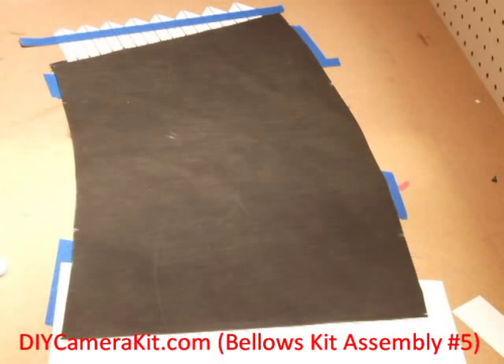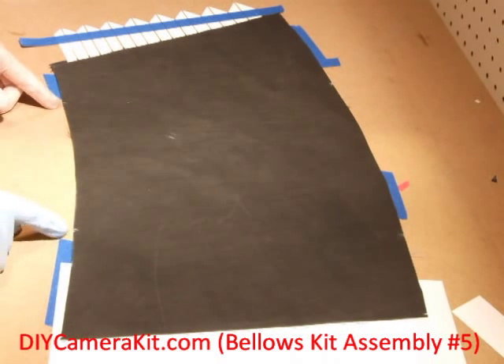At this point, we are preparing to glue the outer cover on top of the liner and the stiffeners. I placed the cover on top of the sandwich using the alignment notches to place it exactly in position. The alignment notches on side one and side two of the panels of the liner and cover should overlap.